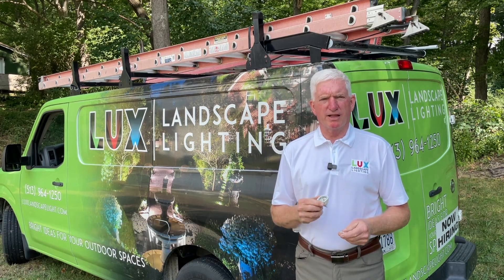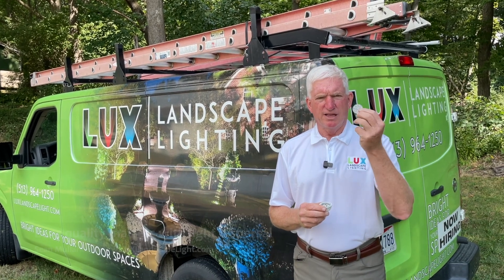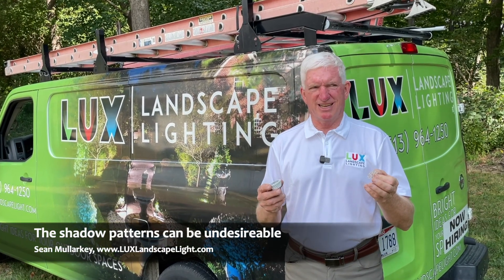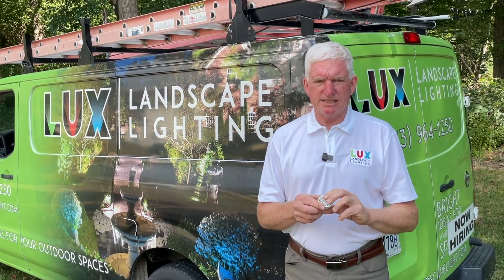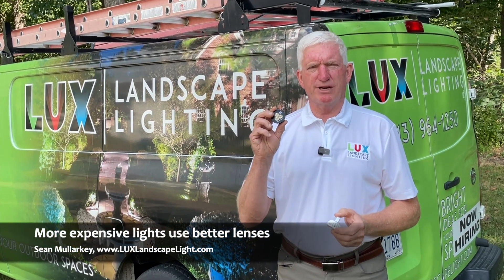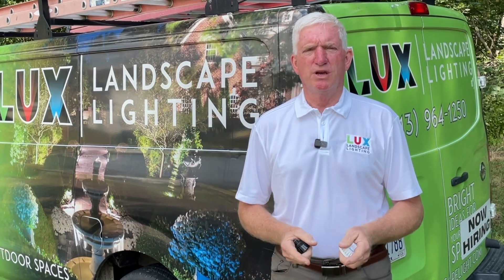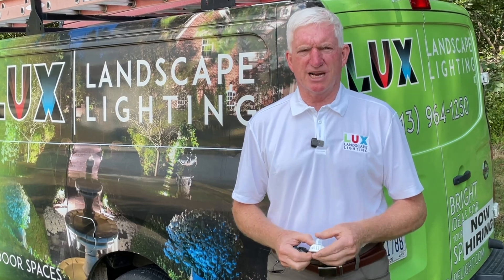The other thing that's really important with LEDs is the lens. If there's no quality lens on them — here's the lens I took off that one — the lens disperses the light, and depending on how it's made, it can create some interesting and sometimes distracting shadow patterns. Inexpensive lights typically don't have very good lenses. The expensive lights we use have a very nice lens, so the light distribution is very uniform without unevenness or funky shadowing around the outside.